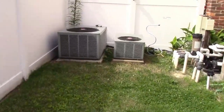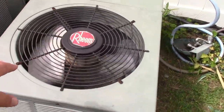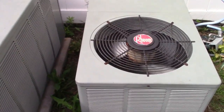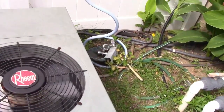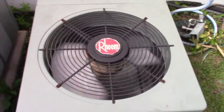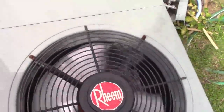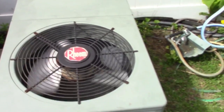Could the fan just stall out in the middle of running? The times I came out, it was definitely running, but I think the fan is running smoother than it did and the compressor starts up better than it did — that's for sure. Because I'd hate for this to run and run and run and then freeze up again. If this stalled, it would freeze up — there's no question, because we can't get the heat out. Sorry about the construction noise — nothing I can do about that.